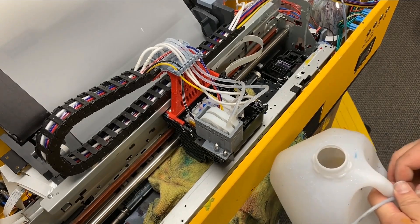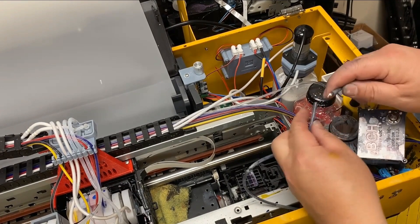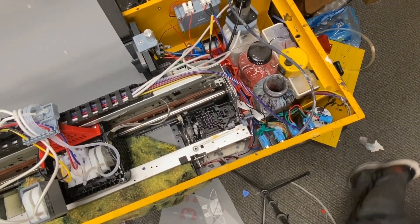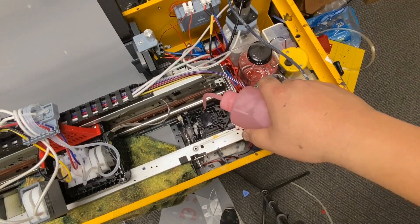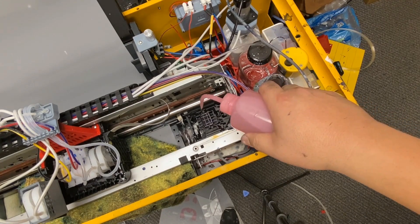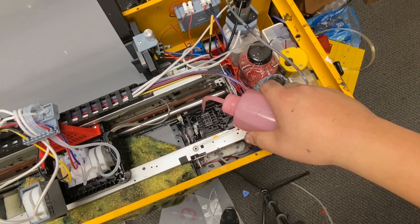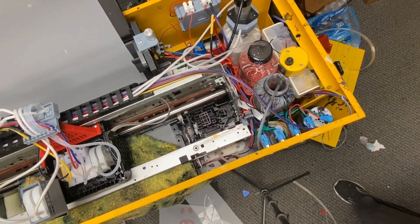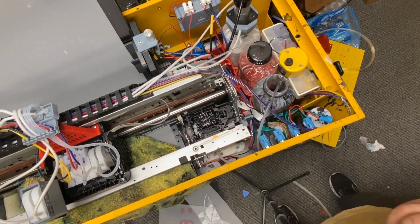We adjust a milk jar and put the other end of the TMS in there. We connect the waste tube to the input of the TMS — basically the TMS sucks ink from the capping station. We turn the TMS on and start squirting water on the capping station. I usually use half a bottle, and every time you need to use at least half a bottle — don't just think it looks clear, use half a bottle every time. If you damage a printhead, it costs you a printhead. If you damage the capping station, it costs you a printhead and a capping station.